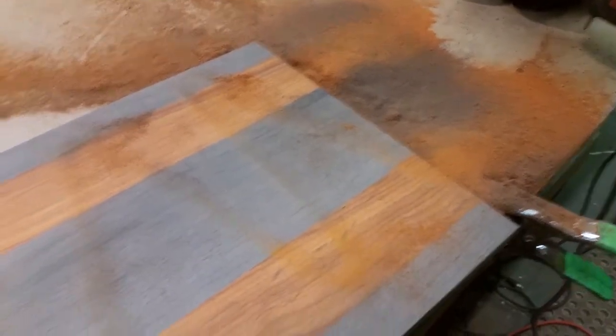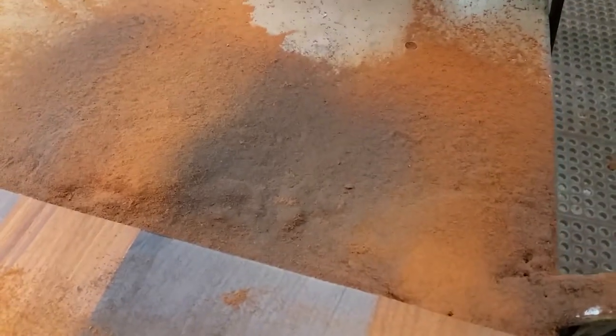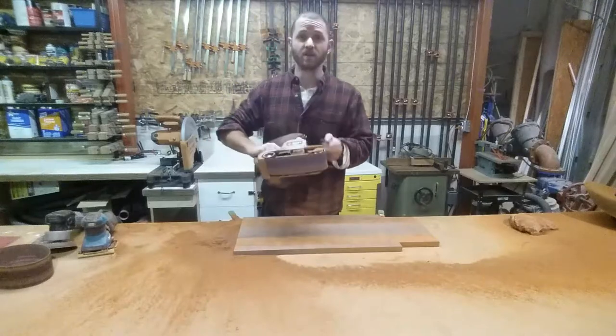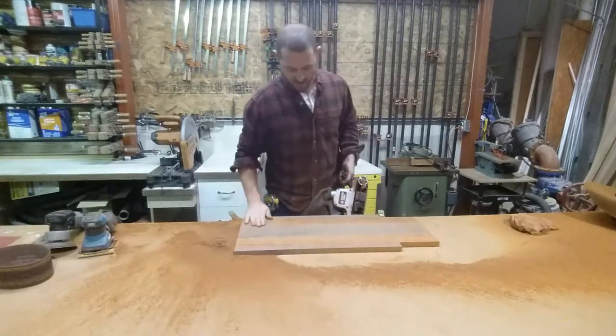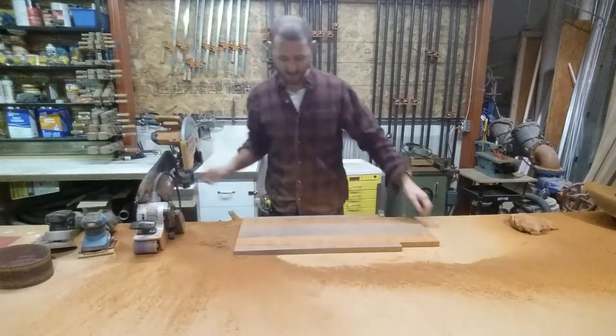Just got finished smoothing out our piece. Put the 100 grit on the belt sander. And that sawdust — look at that awesome color from the padauk and the Peruvian walnut. Also colors everything orange, because yeah, it's orange. The more steps of sanding you do, the flatter and smoother this will get, so make sure you do both sides with all your steps.